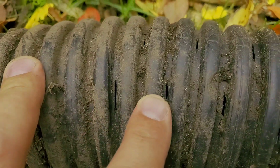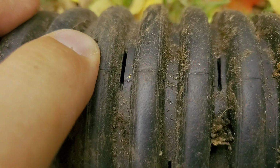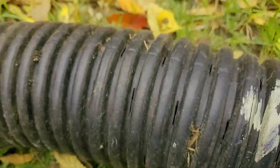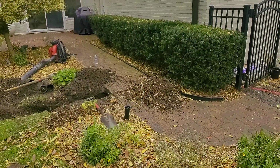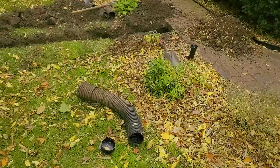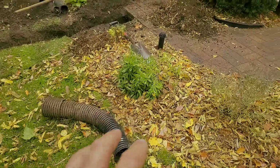So when the downspout is dumping water and it's pouring into this pipe, the water's shooting out of these perforations like a giant sprinkler. I've seen these during a hard rain, and I know what it looks like. So you think you're doing something good, and maybe you'll lose that water over a length of a certain area, but you really want it to be solid pipe.